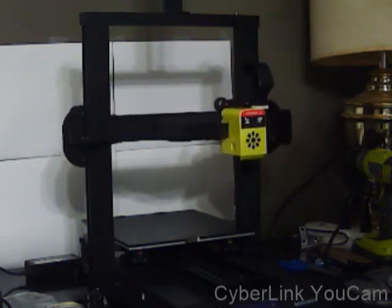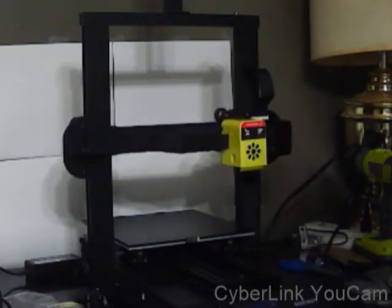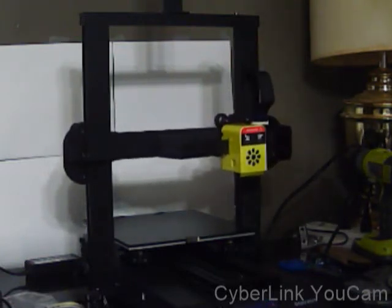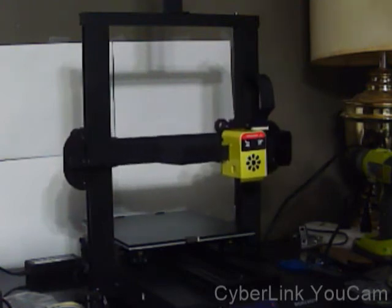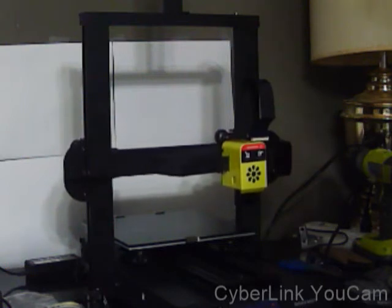Select all, return, or specify axis. Click 4 to turn off the motor. Okay. Start printing. Step 1, leveling. To reset the machine, click home at first and click all. After resetting, click leveling to conduct 5-point auxiliary leveling.